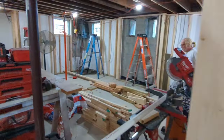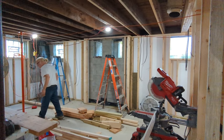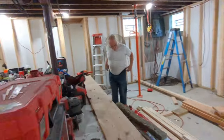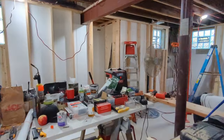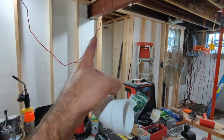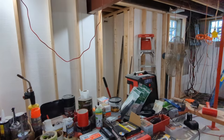Ed's working on framing over there toward the electrical cabinet. That mason's going to be here tomorrow to finish up our windows and our blocks, and we can fill through there. The alcove's got foam in it, and everything like that. We're considering a combination hot water boiler and potable water on demand unit, and then we would try to tuck it all in there, because of course the gas and the municipal water are going to come into that alcove to start with.